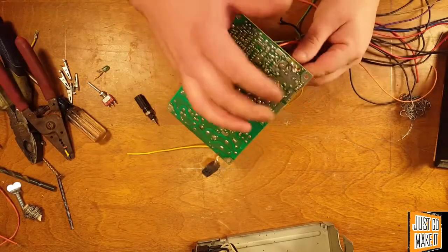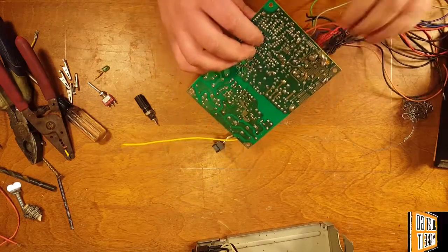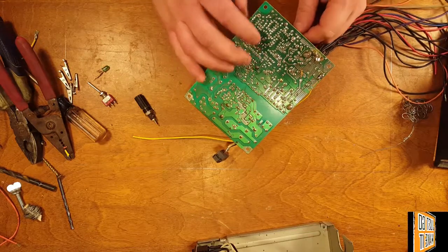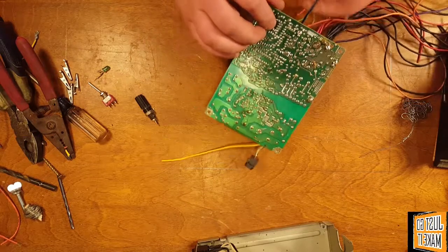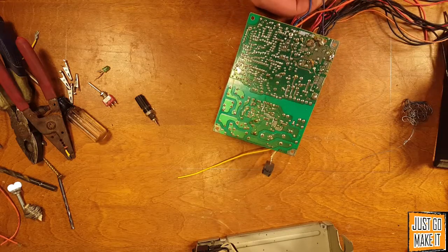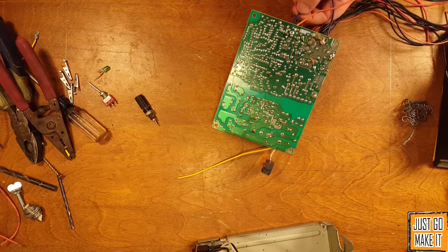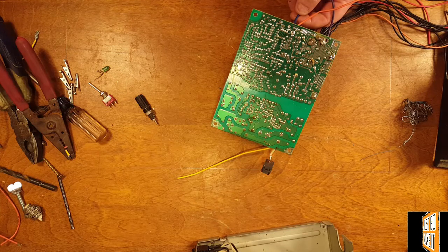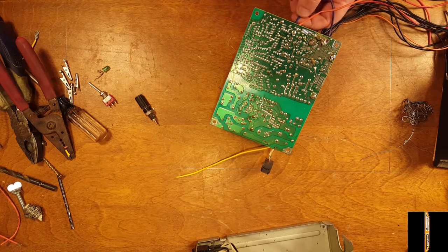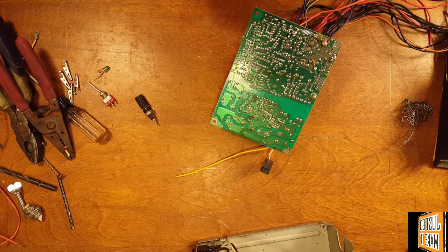As I'm desoldering these bunches of wires, I am taking one and soldering it back in place, that way I'm not pulling them all out and then not being able to remember what ones went where. Some of the wires such as the blue and the purple — those are negative voltage, a negative 5 volt and a negative 12 volts. I'm just going to cut them off that way I know where they're at, because maybe in the future I'd like to have that feature of having a negative voltage. It's something I've never used, but just in case I ever need it I'll be able to easily hook it up.